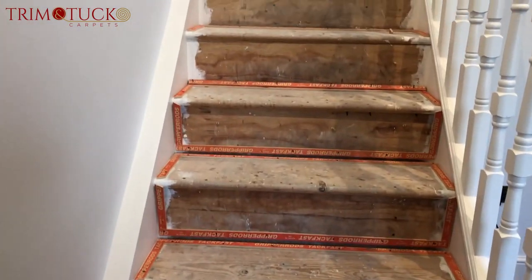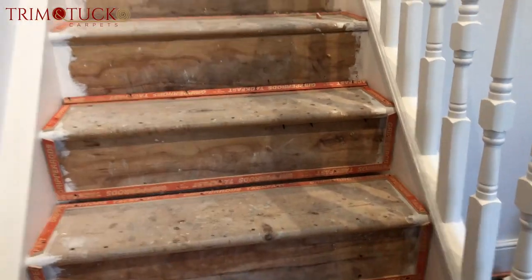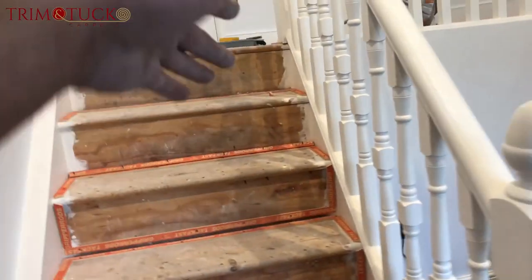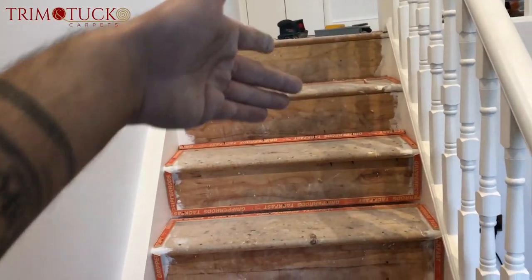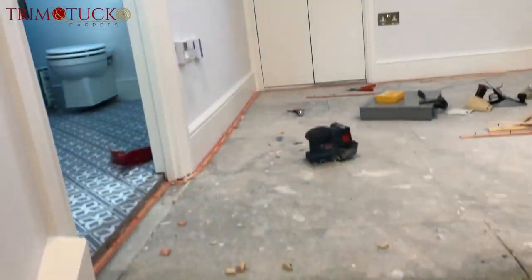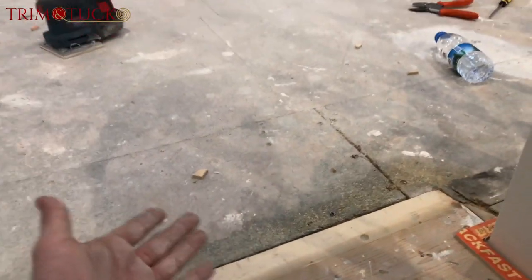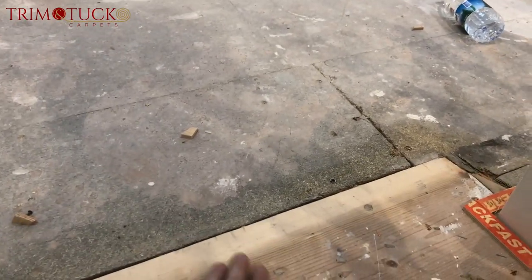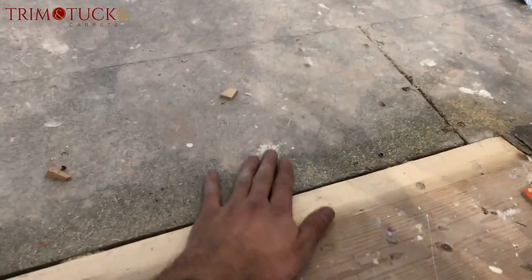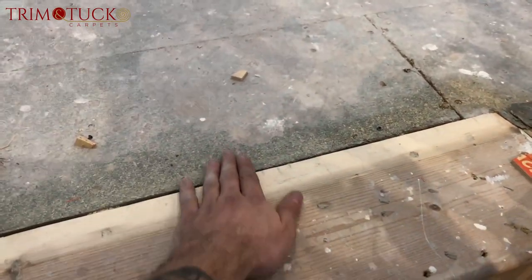This way I like it — it looks very clean. When you see the second part of this video — I think this is going to be a few parts, part one, part two, maybe even part three, it's a big house — you'll see the finish on these stairs. We've got Duncan doing the prep. I had to sand this down a bit because the builders made a lip, and I knew that would be seen once it's all stuck down. Because the customer's a top guy, we've sanded it down so it gradually goes into an even finish.